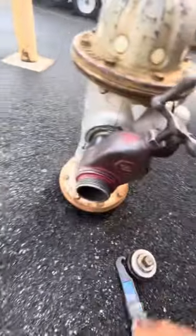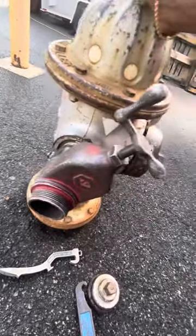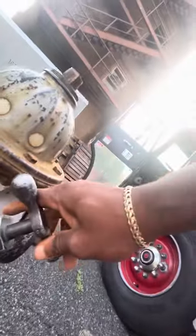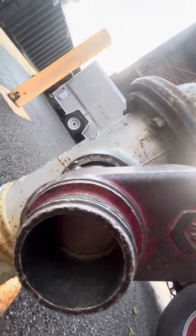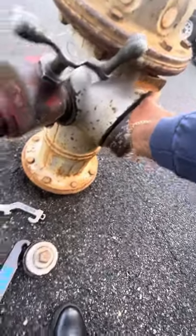So the gate is pretty tight. Now the reason the gate is here is — when you're done you want to open the gate. Right now the gate is open, so you want to make sure it's closed when you're opening the hydrant. I'm using the top here to close it. You see it's open, and now it is closed. So right now the gate is closed until I open the hydrant — no water is going to come through here.